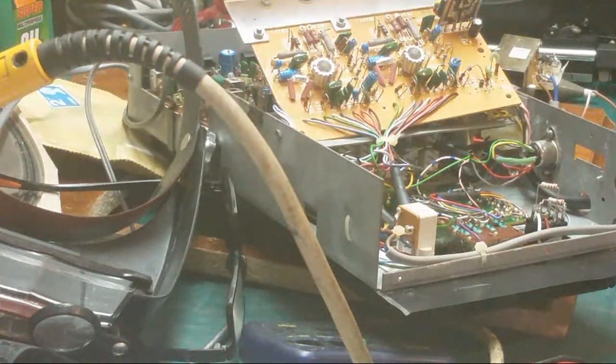Has the regulator blown of its own accord, or something blown it? I think it's just blown with age. Oh well. I think the transistor's been blown by the diode next to it. Because the diode's completely blown. I mean, it's blown apart. So that's what's killed the transistor. Just check the transistors as well, make sure they're okay. Yeah, the outputs, on the driver.